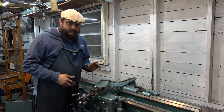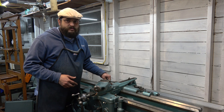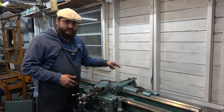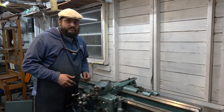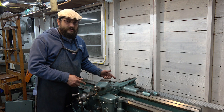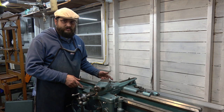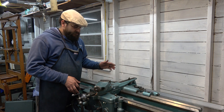The screw that is in this lathe does not have that telescoping feature. Unfortunately, because of that, and because of the way the nut is on the screw and it's not easily disconnected, it makes it impossible to use the taper attachment. Right now the taper attachment is just for looks. One day I do want to replace that screw with the correct screw for this machine, because that screw is not in good shape — it doesn't work properly. It's got a lot of slop in it and is also extremely tight in places. I did a lot of work on it but it's just not right.